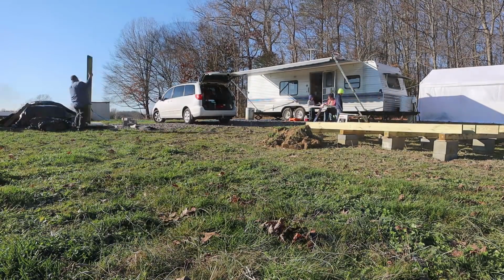I have all of the floor joists cut to their length, and I have them roughly spaced out, just placed out here on the skids. I'm going to talk about a couple of things as we frame up this floor and we do all of our attachments and stuff. I'm using 2x6s for this floor structure, which should be plenty strong enough for my intended uses. A lot of times storage buildings will be framed out of 2x4s, and that's not enough.